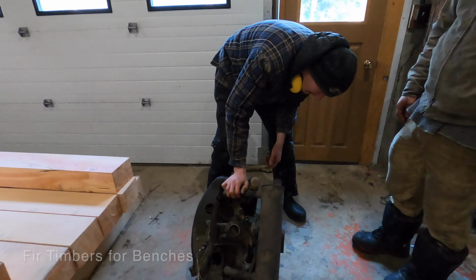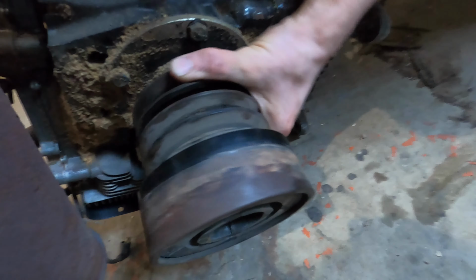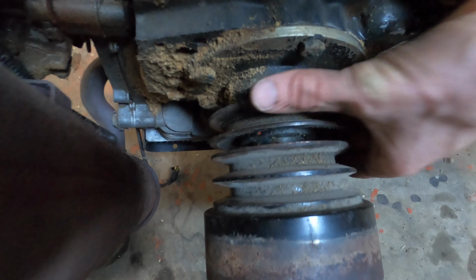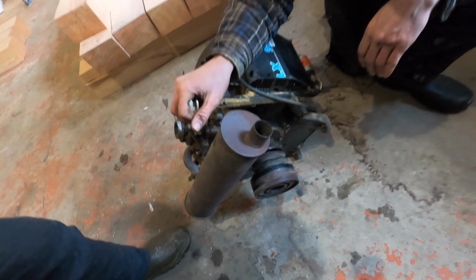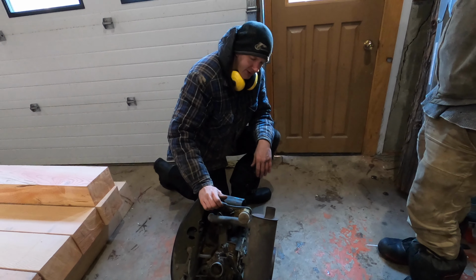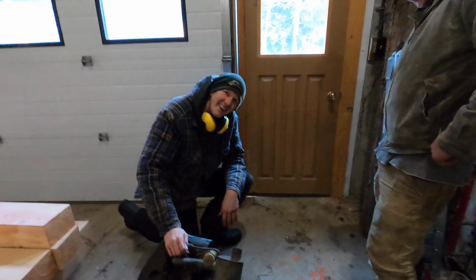Unfortunately, both the clutches are stuck in the same spot. We've got a tiny little Allen key way inside in between these two pulleys, and that Allen key is stuck. So on the last clutch that we took off of our motor that's on the mill, we couldn't get it out, so we just used a puller and pulled it right off of the shaft. And made a kind of a big, nice, long scratch from the shaft. What, I'm finding this out for the first time.